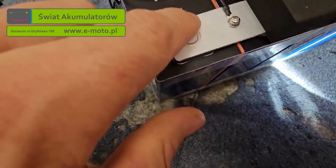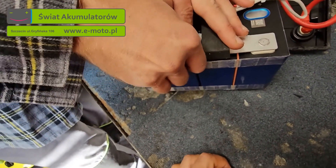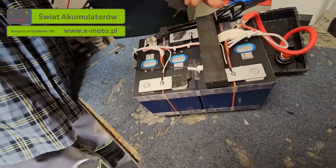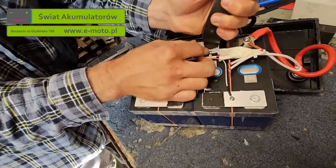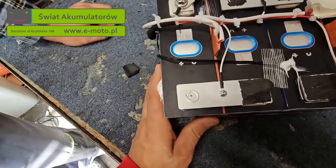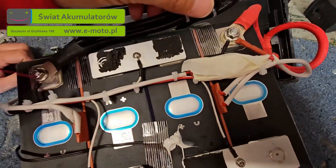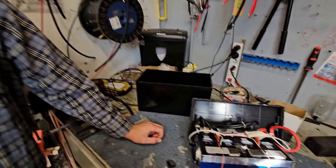As you can see, the cells are not screwed — these are factory welded cells. Here is the weld. Let's remove those sponges as well — these are all protective sponges to keep the cells from moving around. This is what the overall aesthetics of this cell look like. The cells look nice. They are decently welded and twisted with solid cables. No issues here, Vadim — we've disassembled more than one battery. One could say that this one looks fairly solid. It looks very nice design-wise, and from the tests, it also performs well. It might turn out that we found a nice manufacturer with decent products, and the price will definitely be more favorable as well.